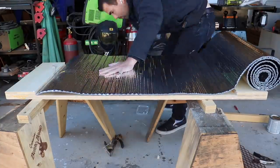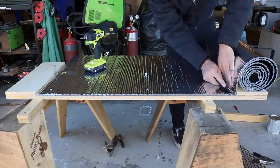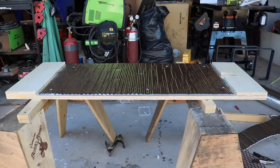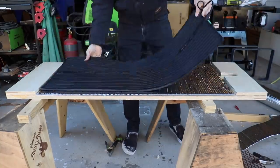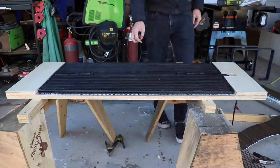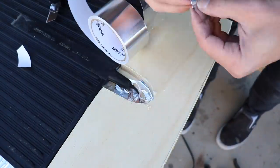I want to push the heat up towards the concrete and away from the plywood, so I installed a layer of reflective insulation — it's kind of like bubble wrap that I got from Home Depot — and I just used some half inch pan head screws to screw it down. I placed the heating mat that I bought from Amazon, ran the cord through the hole, and then applied some reflective tape around it.